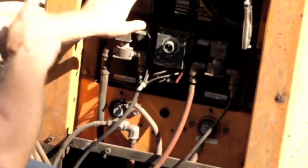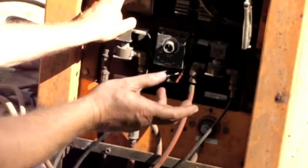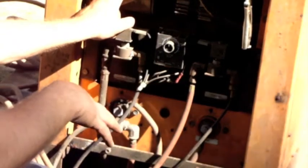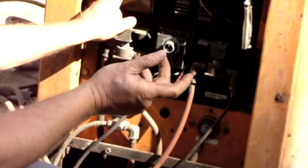This unit right here is a large capacitor. Above it, under where it's hard to see, are two additional capacitors, and I can actually see brownish liquid that has leaked from those units and is running down the inside. This is a common problem on these older welders — capacitors go bad, the chemical inside leaks out, which messes with the capacitance value and causes problems. Those capacitors are also in the high-frequency circuit. Apparently from what I read online there are no direct replacements, but there are several off-the-shelf parts that can be combined to create replacements.